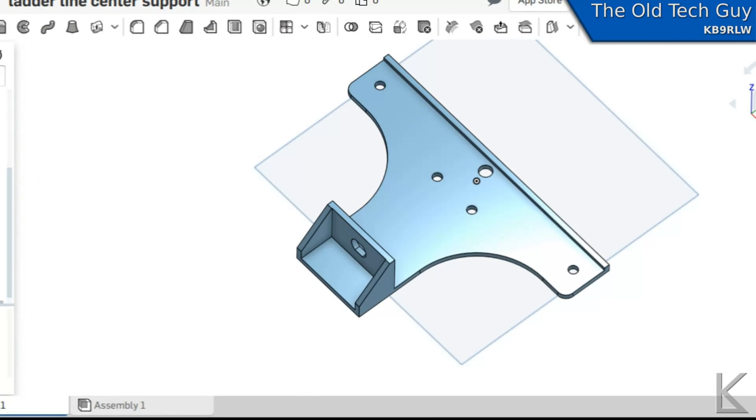In order to connect the center feed point, I needed some kind of structure that I could lift the antenna up with and hold on to this wire. So I fired up the 3D printer and went into Onshape and designed something. The ladder line will lay across here; this ridge rides across the top of it. These holes are for punching through the center part of the ladder line, putting a couple of zip ties in to hold it rigidly and take up the load. This hole you can put paracord through and tie it around the ladder line as your support structure for lifting the entire thing up. These two holes are for screw terminals where the ladder line will join up with whatever is connecting it to the connector.